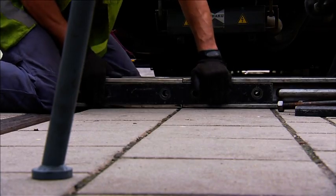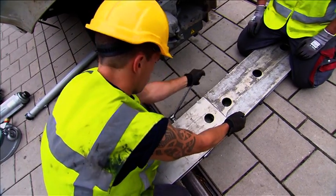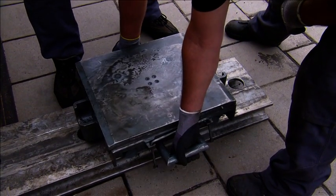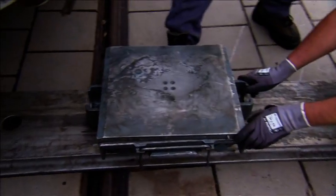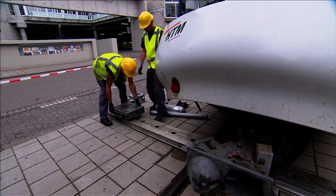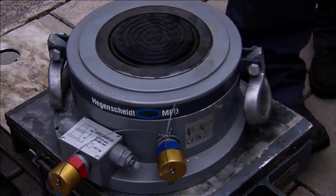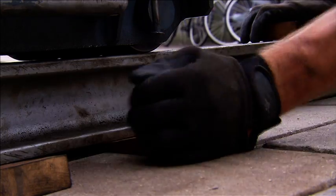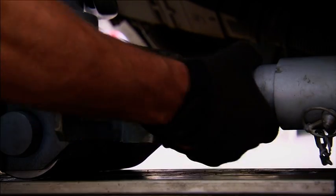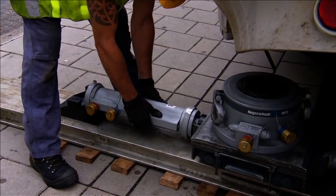The re-railing bridges are connected to the bridge coupling and aligned underneath the vehicle. The roller carriage is placed on the bridge and the hydraulic telescopic lifting jacks are positioned on top of it. The distance bar is set and attached between the roller carriages, and the counter support is fastened on the bridge with the displacing jack inserted.